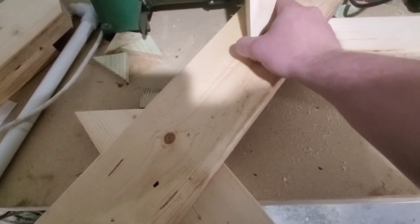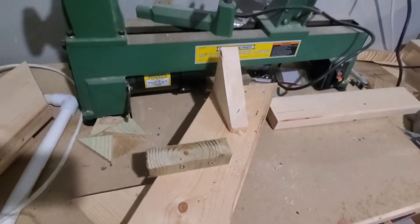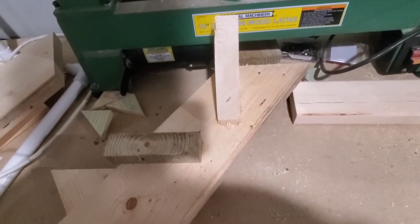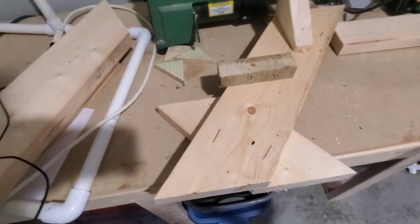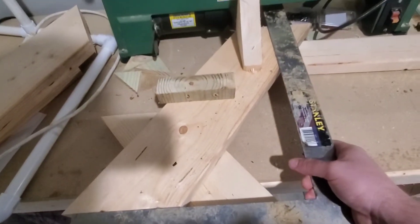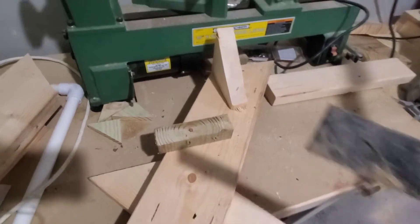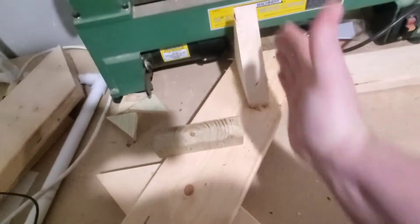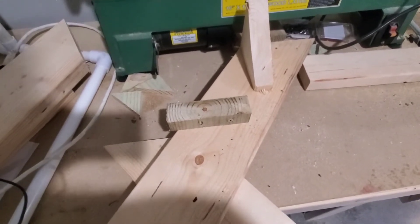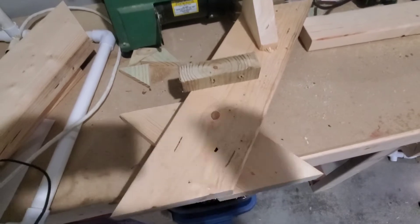I'm trying to decide — you could do it at 90 degrees, I think that'll work. The other 2x6 is going to be roughly there on the other side, so that should be good. If you want to be precise about it, you can just get your big square out, square it up to the bottom like that, bring it in where you want it and mark it. I'm going to get those marked, cut them like that just to make it look nicer, then figure out the width and get these screwed together.